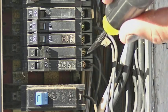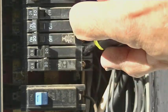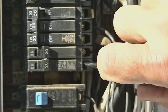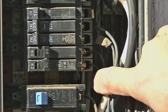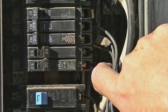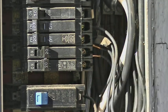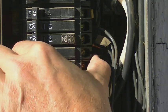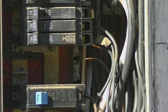Once we've done that we can loosen up the screws that hold the wire in place — loosen one and then loosen the other one. Once you have those loose you'll be able to pull the wires out from it. You want to make sure that when you're pulling those wires out that you don't touch any of the other load lines on any of the other circuits. Once you have those out, grab the front part of the circuit at the top and lift up hard on it, and then it's going to slide the clips out from the back side.